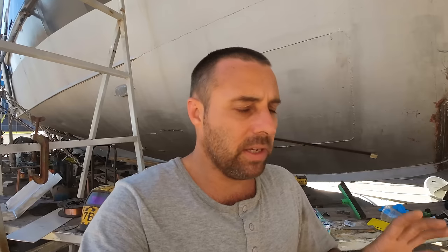We can't add too much thickness to the outside of the tanks, because then it won't physically fit in the boat where they're made to suit. So the outside will be getting glass, but it'll get one layer of a relatively thin glass, and it's going to be faired so that it looks neat and lovely, etc. It's not really about strength on the outside, it's mainly about protection. The inside is where we're going to be putting all of our effort to do all of the coving and do all of the bulking up of the glass to get the strength.